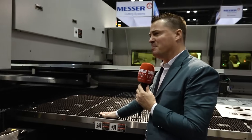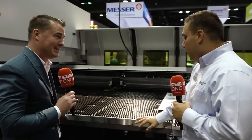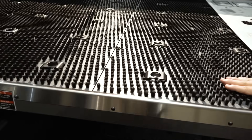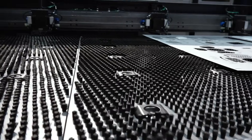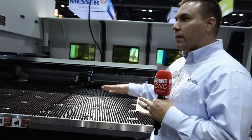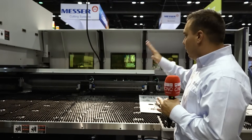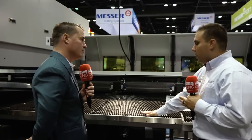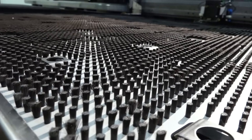These brushes might actually be softer than the bed I sleep on in most hotel rooms. The softness is something important to mention — obviously we're doing a lot of different material with this machine: stainless, copper, aluminum, and sometimes you've got to be careful about scratching. So a brush table is becoming very favorable. However, in typical turret punches, brush table has been a concern because with thicker, heavier gauge material the brushes can flatten and become a consumable cost. We decided to incorporate high-density nylon brushes specifically meant to withstand the weight of five-by-ten quarter-inch material throughout the longevity of the machine.